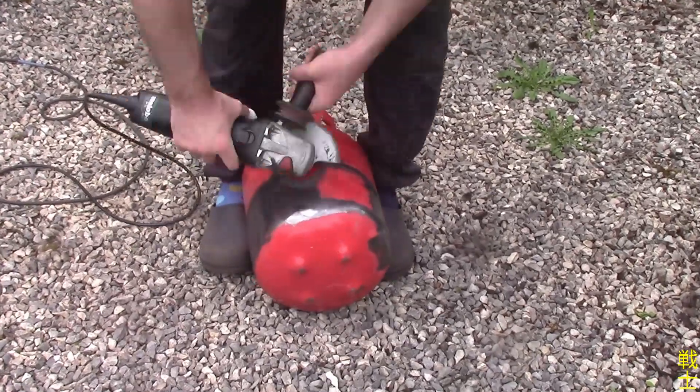I will use a heat resistant refractory. I mix it to the shown consistency and start scooping it into the bottom section, making sure I cover all of the fiber mat. To make sure the floor of the forge is nice and flat, I add these angle irons — they also help with constructing half of the walls. This refractory can be hardened by blasting it with the burner right away, but look out not to overdo it, as trapped evaporating water can release in small explosions, throwing chunks around. After blasting it for a bit, I can remove the angle irons and reveal the nice sharp corners they gave me.